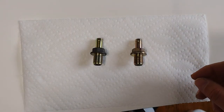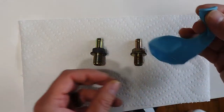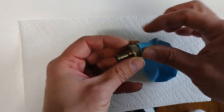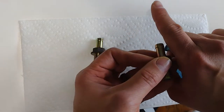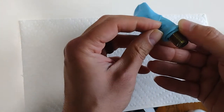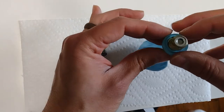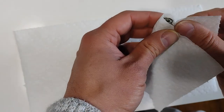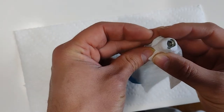The way you can test if these valves are actually working properly is to use a balloon. You grab the valve and cover this side — remember, air should be able to flow this way but not back that way. It should be pretty sealed all around because the balloon is compressing against it. So you wrap a napkin around the exposed end and blow on that end.